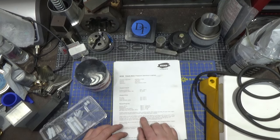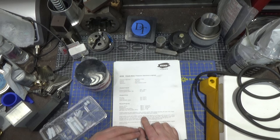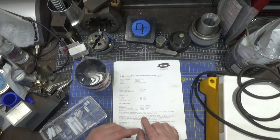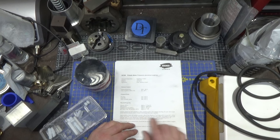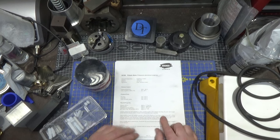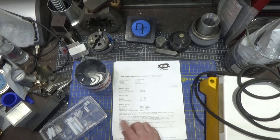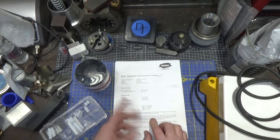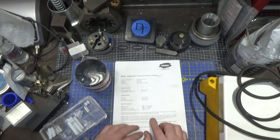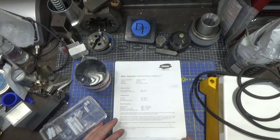The amount of alum you can dissolve in water is shown per 100 grams of water. That may sound confusing, but since the density of water is one gram per milliliter, 100 grams of water is 100 milliliters — easy to measure out. So 100 milliliters dissolves about 5–6 grams at 0°C, 8.5 at 10°C, 12 at 20°C, 25 at 40°C, 37 at 50°C, 58 at 60°C, 94 at 70°C — getting pretty hot now, that's around 150–160°F — and 195 grams at 80°C.